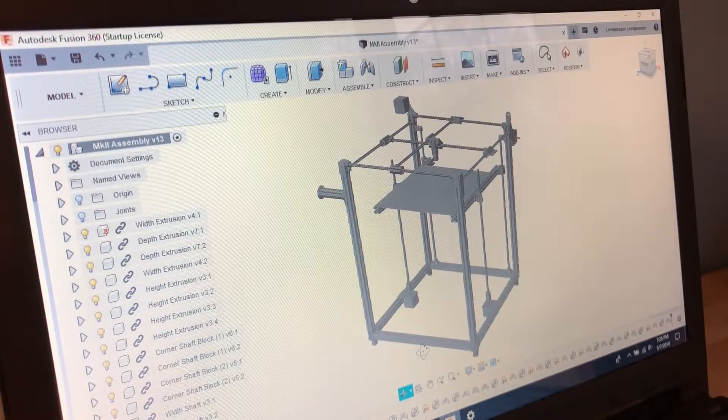I'm very happy with this design and I'm about ready to move on to the next steps. Now that the design is finalized, the next step is to start collecting all the pieces — this means ordering the parts I don't have, making the parts that are custom, and cutting everything to length. For the custom parts, I have to CNC some aluminum bracketry out of 2 millimeter thick plate. I'll also have to 3D print some blocks for holding the linear bearings along with pieces to hold the linear rods. I'll do my best to document this whole process.